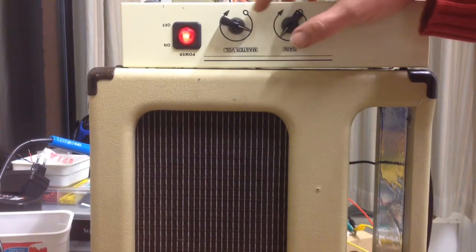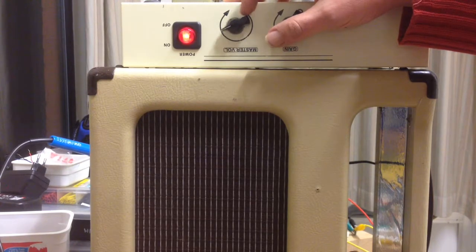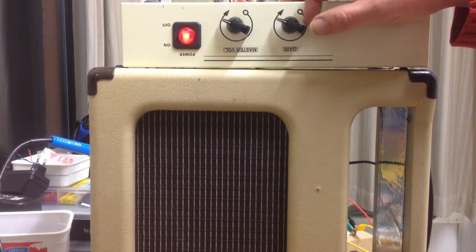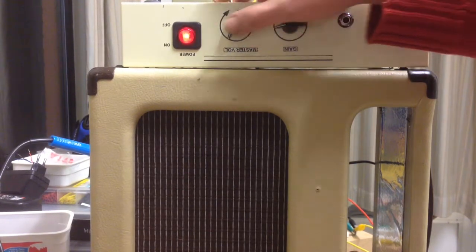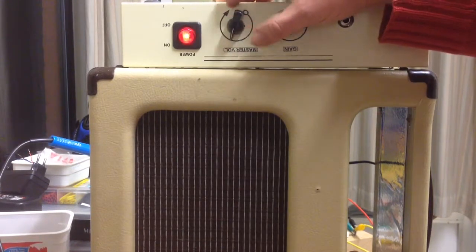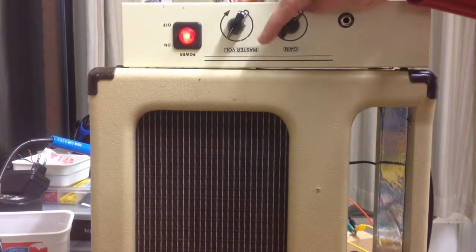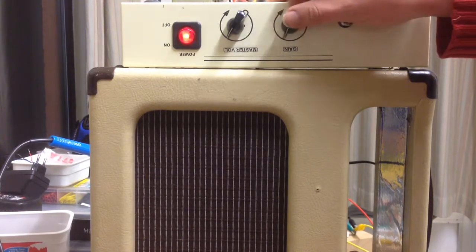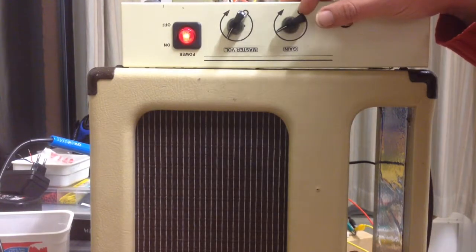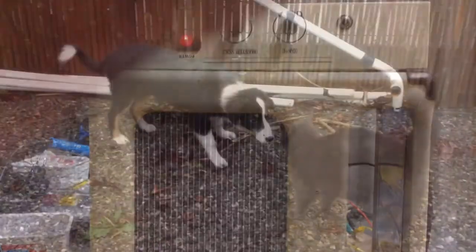While looking at this issue, I discovered that the volume part has some oscillation issues if you turn it up very high. I'll need to put in an extra resistor to keep some resistance even when the master volume is all the way open. As far as crackling on the gain knob, it seems to have gone away by lowering the gain on the preamp stage, but I might change it another way so it's not a scratchy pot.